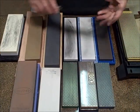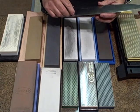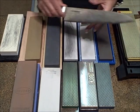But if you really want to feel the force when it comes to knife sharpening, then the most versatile way of doing it is freehand with a multitude of different stones and tools that will allow you the widest breadth of edge refinement and creativity that you could possibly find. With hand sharpening on stones, 8,000 grit, 6,000 grit, 20,000 grit, you can get to that kind of fineness with certain pastes, powders, and rouges out there. You can get up to 60,000 grit on some of the leather strops and pastes or powders. But do you really need to do that?